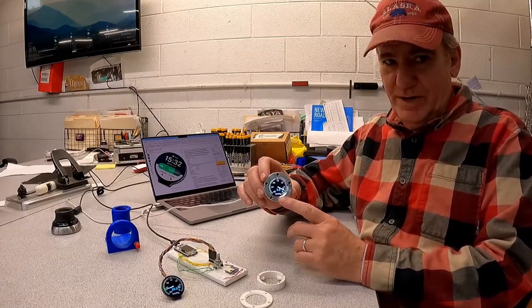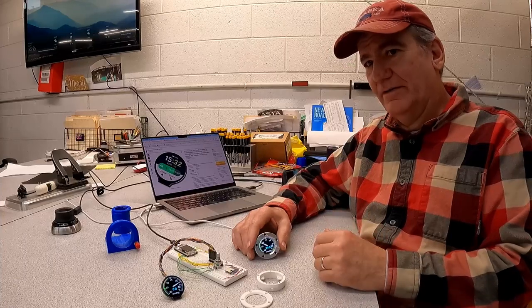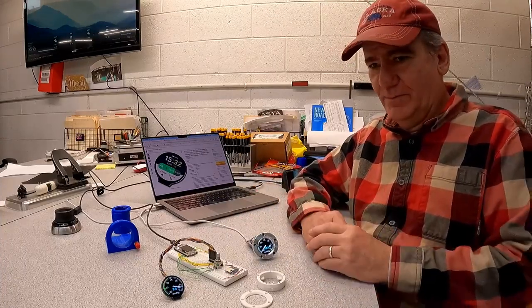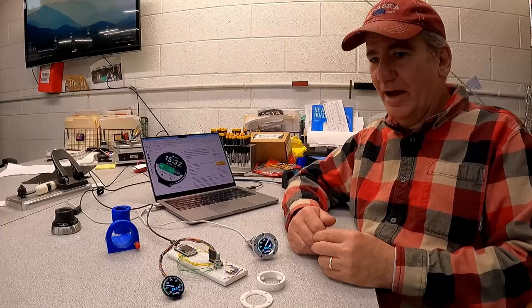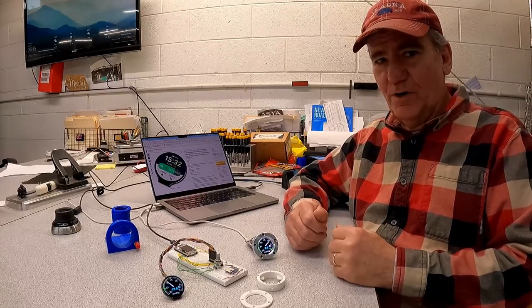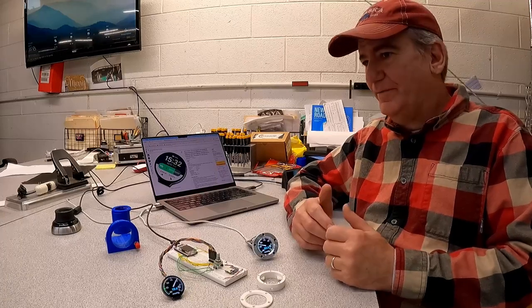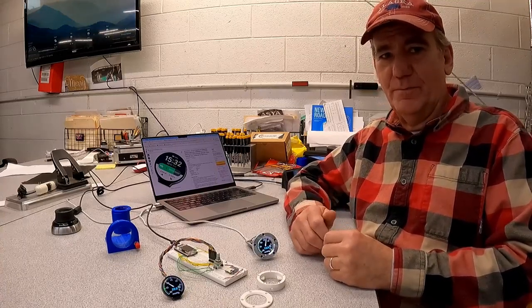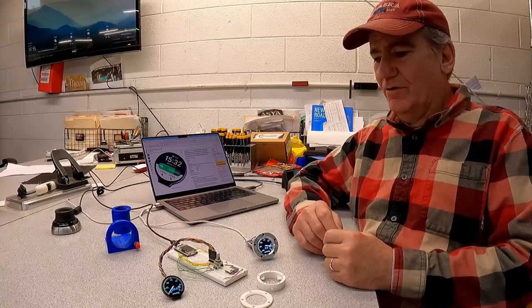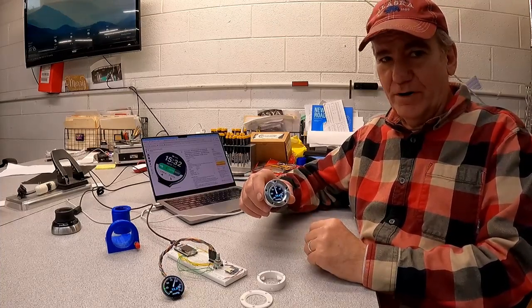So I'm making a vacuum gauge. I actually need a vacuum gauge. I've got an application, a Haas VF5, and I've got a vacuum chuck in there. And I'm trying to control the vacuum pump to maintain the vacuum. Right now you have to kind of stand there and monitor the thing to make sure that you maintain vacuum. If you generate a small leak, when the machine's moving around, the hoses are getting flexed, and tiny little leaks develop, so you have to keep cycling the vacuum pump on. Every 4 or 5 minutes you'd have to turn the pump back on and draw the vacuum back down. So this gauge is going to monitor the vacuum for me using a sensor and automatically turn the pump on and off for me.